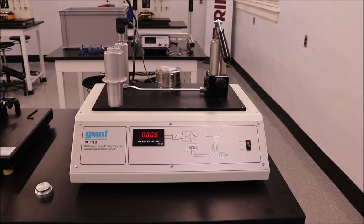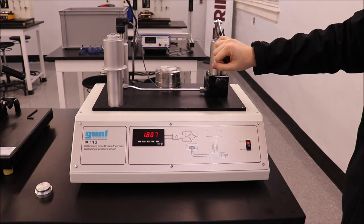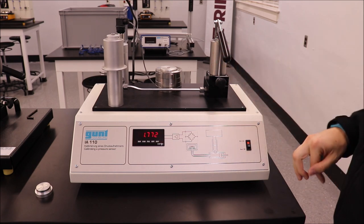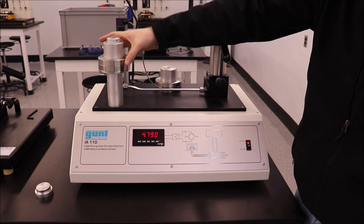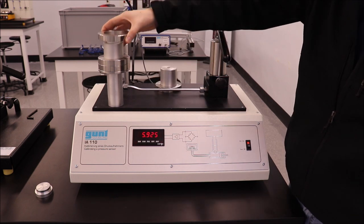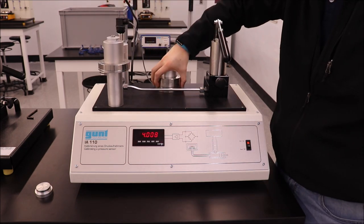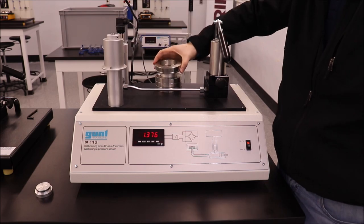Place the piston in the cylinder. Make sure the piston is adequately supported on the oil cushion, adjusting the compensation handle as needed. Before taking data, one by one load the carriage piston with each weight, allowing the system to come to a roughly balanced value for each new weight. Then unload all weights leaving the carriage piston. Proceed to step eight and begin taking data.